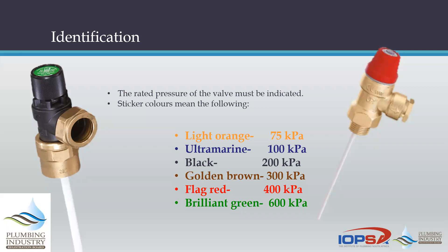There's a misconception that all valves must match the pressure rating of the system — that every single valve, be it the PRV, the TP, and even the vacuum breakers, must be rated at the same pressure. That's not true. Only the TP must match the cylinder. The PRV can be equal to or less than the cylinder's pressure rating. Match the TP to the cylinder, not the PRV.